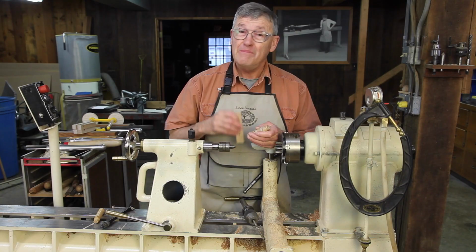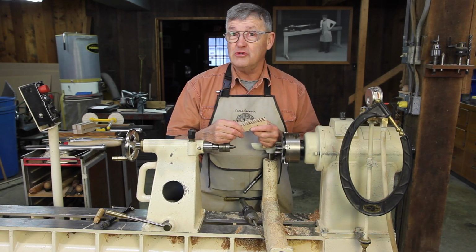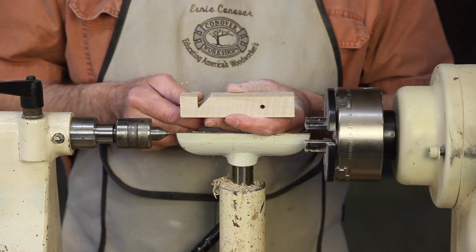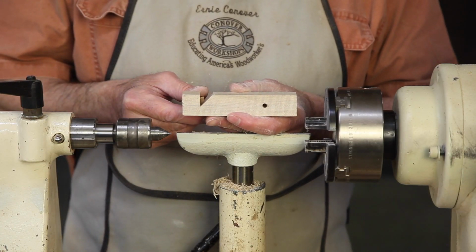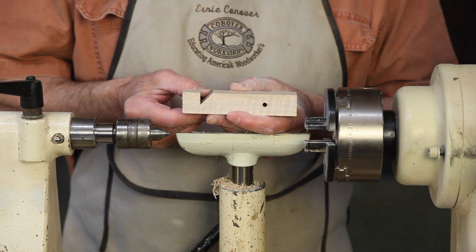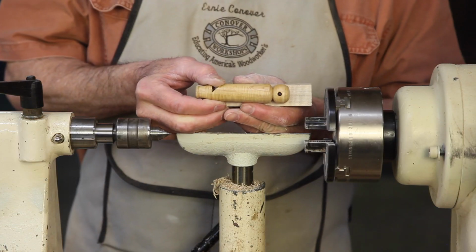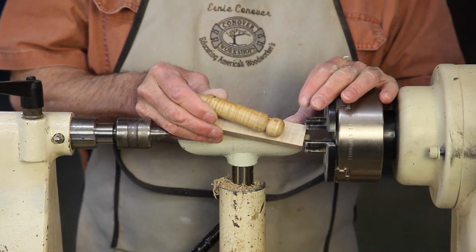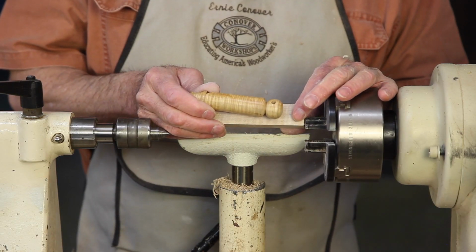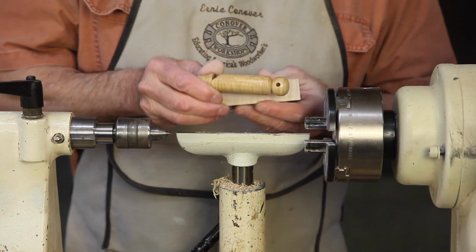It's a great little turning project. Best of all, it can be done very nicely in a mini lathe, although I'm going to use a rather large one. You need to start out with a 5-inch long by 1-inch square block of maple or other durable wood. The finished whistle is going to be 4 inches long, so this gives us an inch to grab it in a 4-jaw chuck or some waste to discard if we turn it between centers. Either is a good way to turn it.